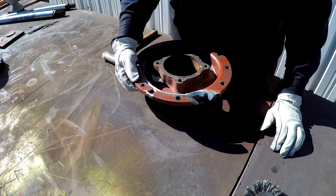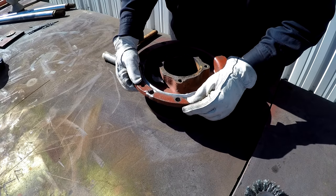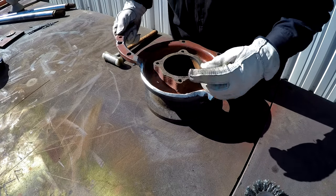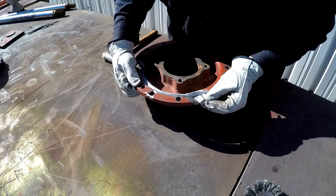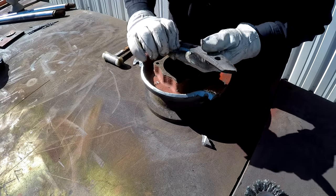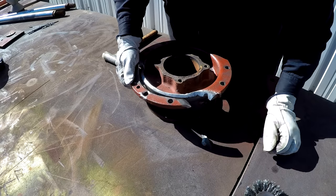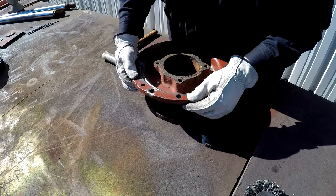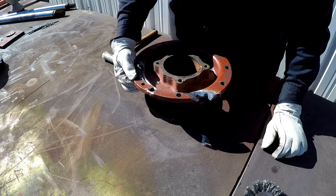So we'll use that to our advantage and get it bolted on here. And then these should just float right there where they need to bolt up to. And we've also got another little piece right here that we've got to get fitted in there, and I'll have to use a C-clamp to hold that in place. But everything will be pulled up flat against the machine side right there, and we'll just fill all that in with brazing rod. Fill all this in on the holes on the end, just weld it all up nice and solid, and then we'll go back in there and line them holes up and re-drill them.